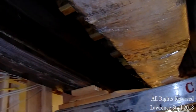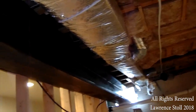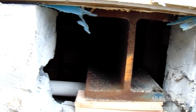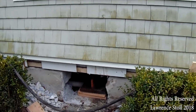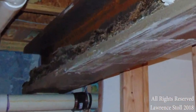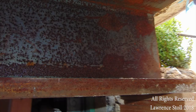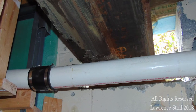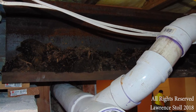You can see the beam is up on the dolly, just being temporarily held in place. This is where the original beam was located, so there really is going to be no change with the soffit — it'll be able to be framed in just as it was before we started. There's the foundation penetration that's going to have to be repaired and reparged. You can see where the beam is seated on top of the foundation there, ready to get permanently seated.